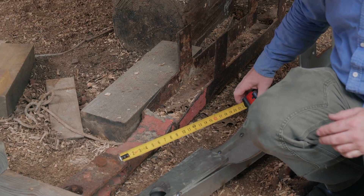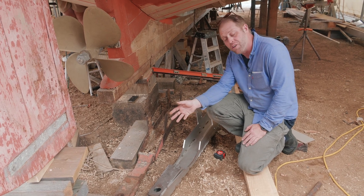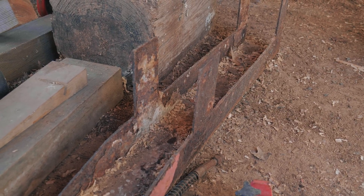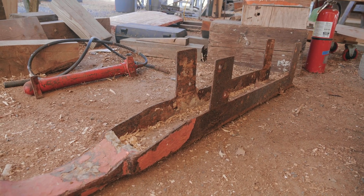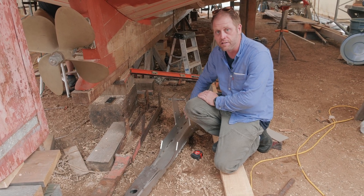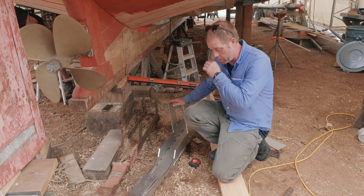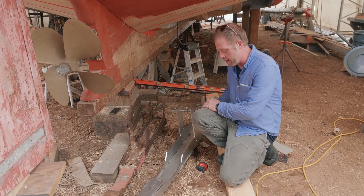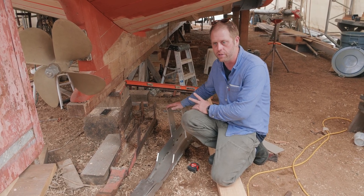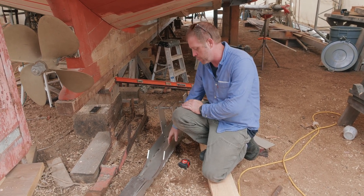Just looking at it you can see that it's been welded together in a couple different places. It's entirely possible that this may have been remade or rebuilt with different welding processes and different types of metal. The one that we have rebuilt here is all 316 grade stainless steel, which is much more corrosion resistant — very common in the marine industry — and it's all made from more or less a single part, so there's less likelihood for it to fail, warp, or twist as it goes into place on the boat.